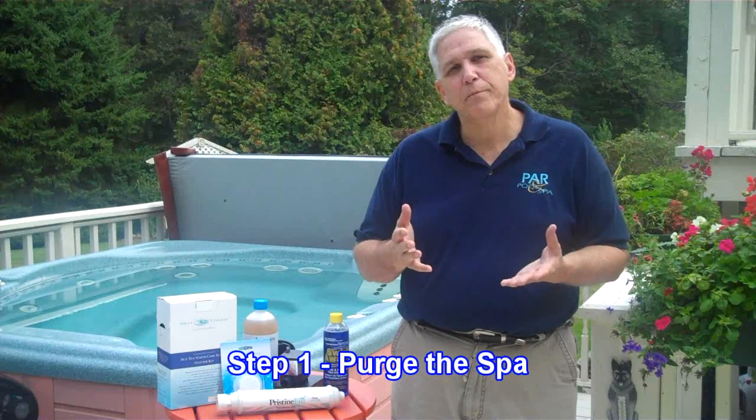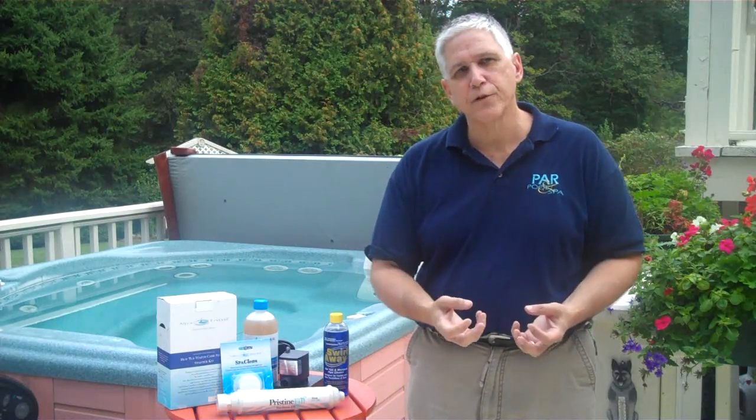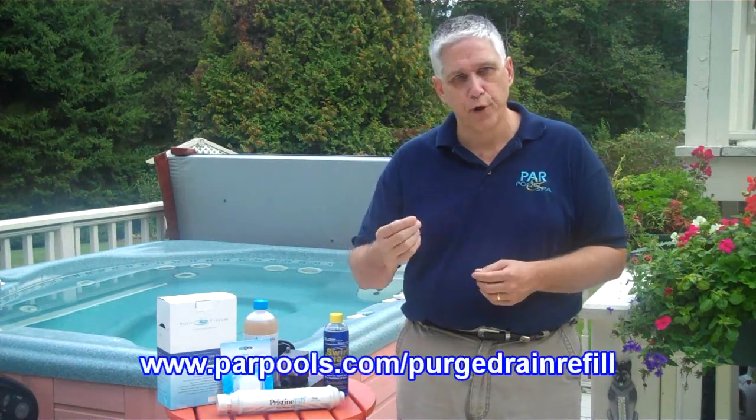Let's look at these three very important steps. The first step is purging. What we mean by purging is you want to do a tremendous cleaning — and it's not just cleaning of the spa surface. You want to get in and clean all those plumbing lines, clean inside where the filters are, clean inside where the heater is, because in all of those spots, and even behind jets and suction fittings, you can have stuff growing. We want to eliminate that. In order to get all of that out, you're going to add one of several different products, depending on how severe a problem you may be having, to purge that spa.